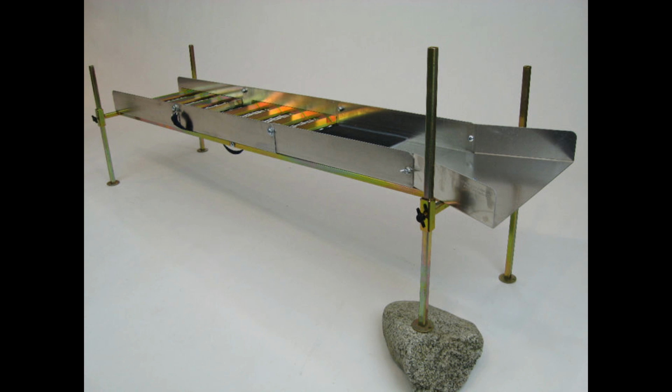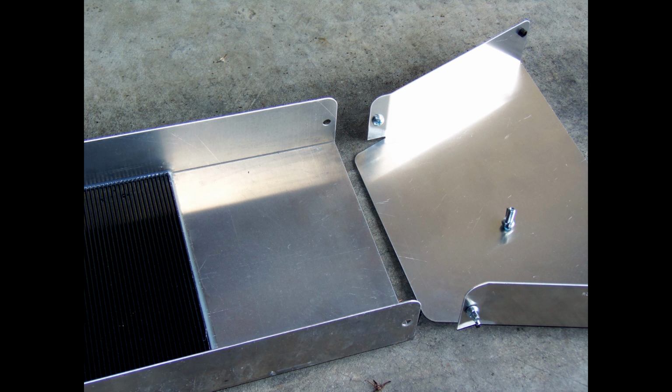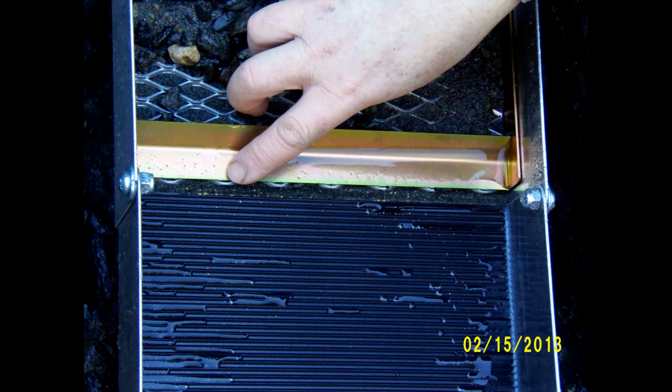It is just under 9 inches wide, and the first section consists of free space. That's where you dump your dirt, and then follows with 8 inches of affixed plastic ribbing. The ribbing is nice because you essentially sample your dirt almost instantaneously, the finer gold being immediately caught in the ribbing and being highly visible.